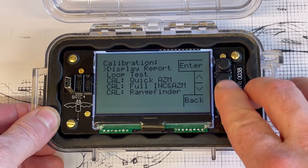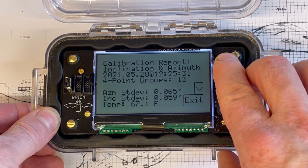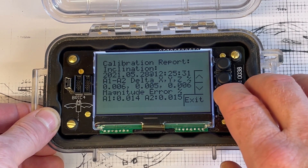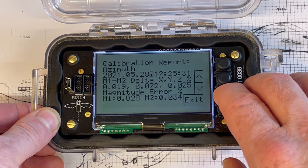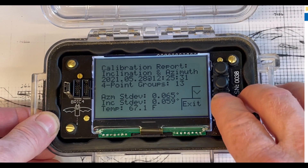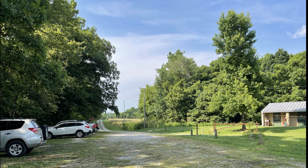The calibration resulted in low azimuth and inclination standard deviations of 0.065 and 0.059 degrees respectively, in addition to small differences between the two accelerometers and magnetometers. The manual states that accuracy of less than 0.1 degrees azimuth and inclination standard deviation can be easily achieved with a little care. Based on that, I'm proceeding on the assumption that the calibration worked. Note that a cave is not required to calibrate the Brick 4 — any magnetic interference such as watches, glasses, or nearby objects can corrupt the calibration.